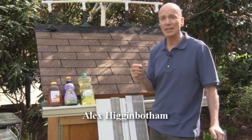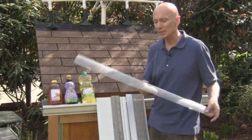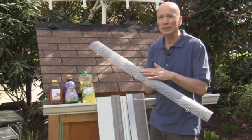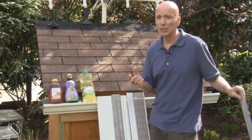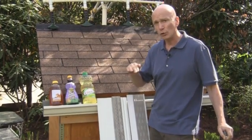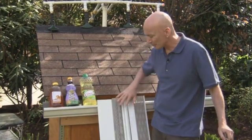from experience that it was oil that had made a lot of the gutter guard products fail. Now, a wide mesh opening like the expanded metal, oil's not going to affect it all that much as far as waterproofing, but most of the gutter guard products out there are going to coat with oil, become waterproof, and the water's going to shoot right past them.